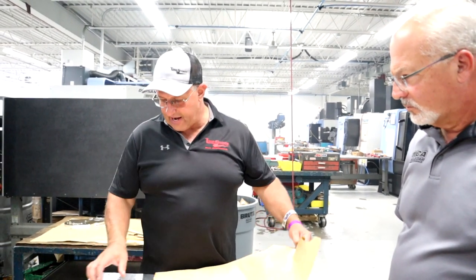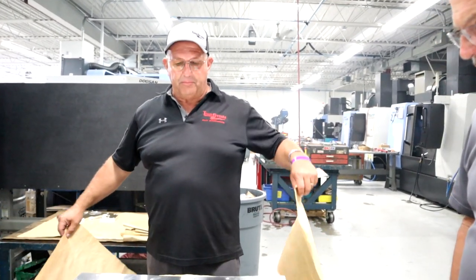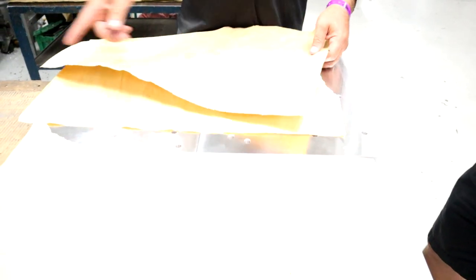Yeah. Well, they're spinning crazy, like 20,000. We balance them like they would spin a really fast turbo. Actually, we don't spin them as fast as a turbo, but we balance them that way. Right. Helps longevity on the bearing and stuff. And then brackets. Start out as just a chunk of metal, and then we put holes in it, and it goes on a fixture and we machine it out to the shape it's got to be in.